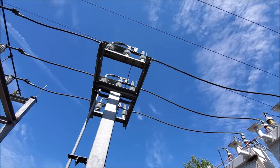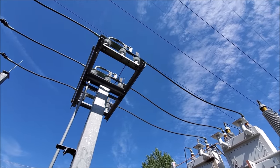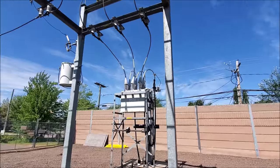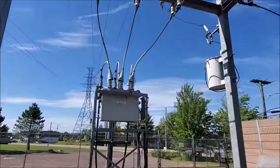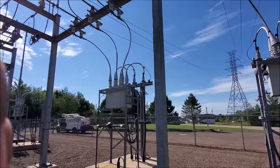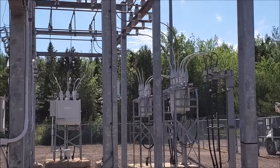Now we're pretty much going to have the exact same steps on the low voltage side as the high voltage side but in reverse. We have disconnect switches close to the transformer and our actual load breaking devices are going to be on the circuits themselves as they go out into the town one by one. This particular substation has six separate circuits.